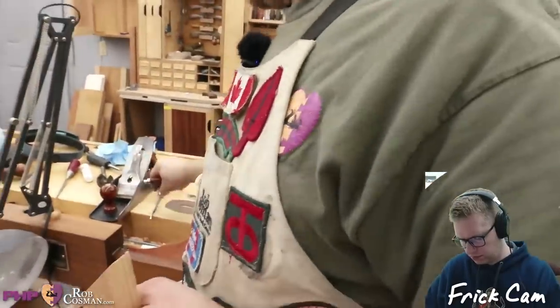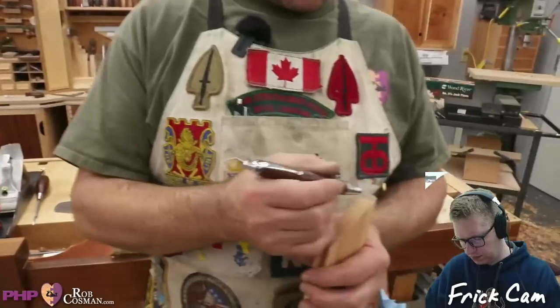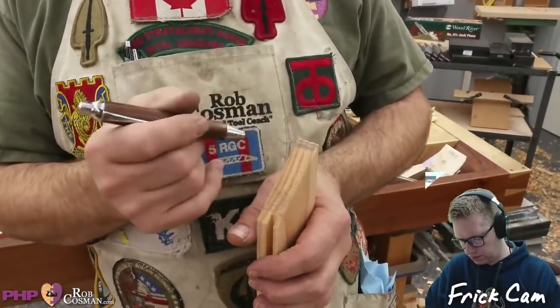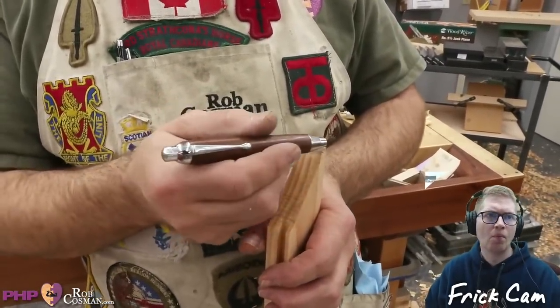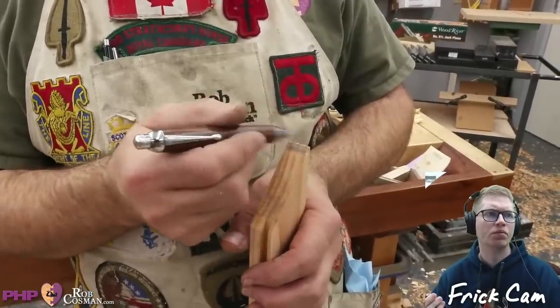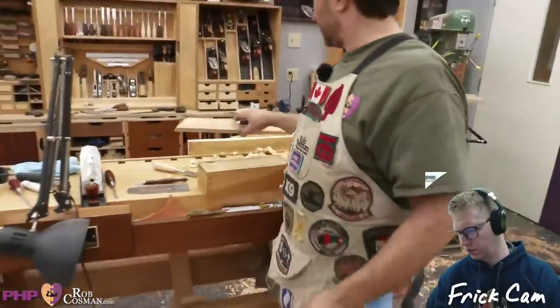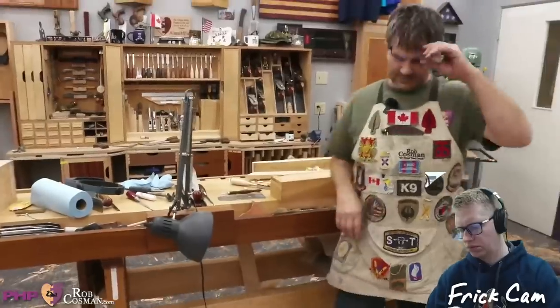You usually can't see the secondaries, because I think what people end up doing is they polish most of the secondary as well. But if the last thing you see on the blade is a dull strip, then you know you haven't raised your blade up high enough. And that's a simple test.